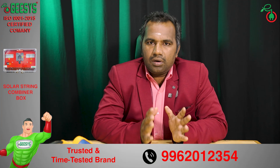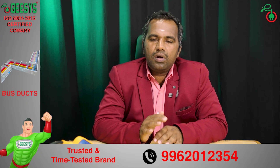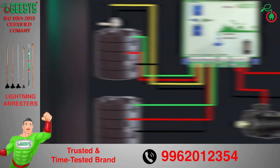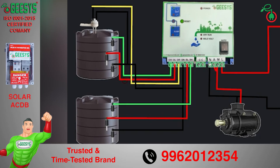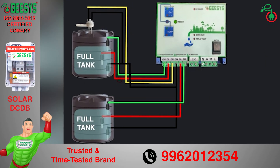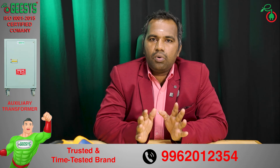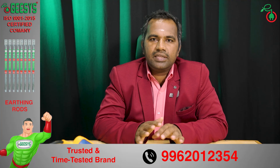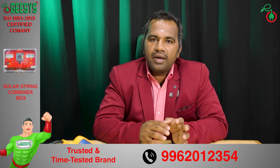What is a water level controller? The automatic water level controller continuously monitors the water level of the overhead tank. If the water level goes below the lower level, the AWLC will make the pump turn on, so the pump keeps filling the overhead tank. When the water level goes above the high level, the AWLC will make the pump turn off, so the water level is maintained adequately without wasting water. This automatic water level controller will safeguard your pump and save your water.